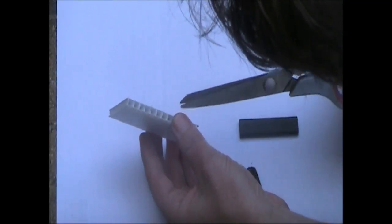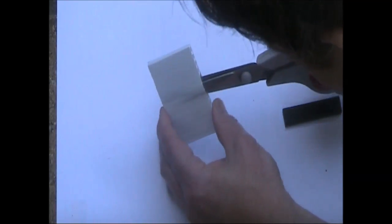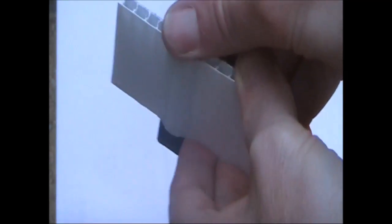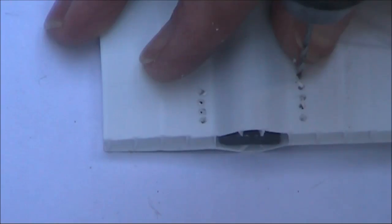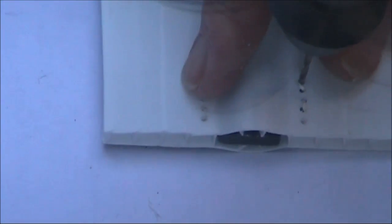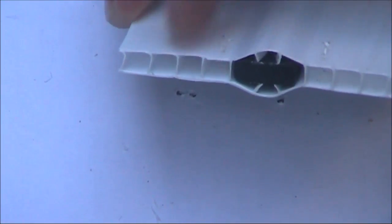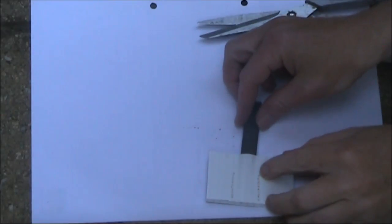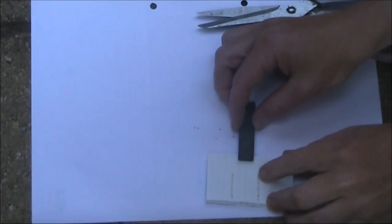You need some scissors — the pointy type so you can fit in. There's spacing of about two millimetres. If you wanted higher inductance, you'd want close spacing. I've lined up the holes with the next gap along either side of the ferrite. When drilling the holes, you don't want to go right to the end, because you need some gap between the end of the ferrite and the start of the winding. That's important to ensure low minimum inductance and the maximum possible tuning range.